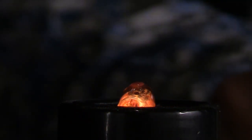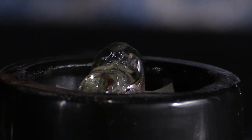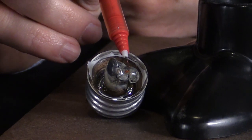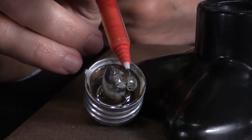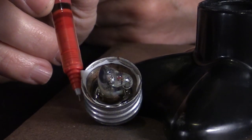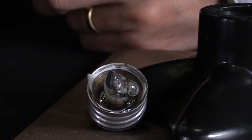Something else that happens when the glass gets hot enough: there's metal dissolved inside here. You can dissolve things inside glass, which is awesome. The metal will come to the surface, and so it's going to look shiny — that's the metal coming out. And here you can see we actually melted the glass. The electricity going through it got it hot enough that the glass actually melted and began to flow. And then as it flowed, it cooled off, and that's when we lost the conduction.